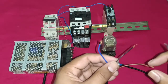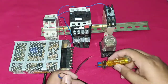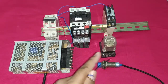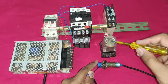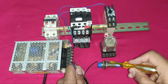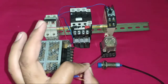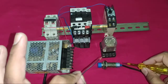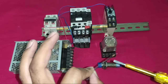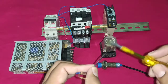The black wire is the output. If you provide 24V supply to red and blue and the sensor detects metal and operates, because it is a PNP sensor the output of the black wire will be positive. If the sensor were an NPN model, the output on the black wire would be negative. But since this is a PNP sensor, when it operates, the black wire carries positive supply.